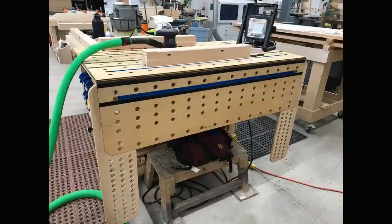There they are. There's a pair of Deadman, right and left, and I added them to the apron with four dominoes, pullet type, with a 1/4 by 20 by 3.5 bolt into the embedded T-nut in the apron. I'm using mostly UJK dogs, Super Dogs and their cam clamps, as well as a variety of ratcheting clamps. I've had the bench in our shop the past two weeks and used it to assist me in building a 7-foot by 9-foot L-shaped black cherry desk for one of our clients.